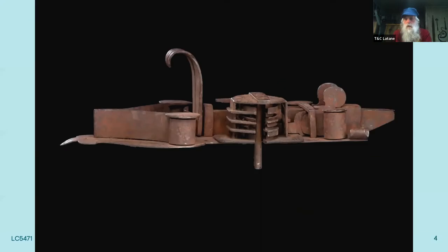This slide shows what you'd see looking at the lock from below. You can see how complex this ward box is — there are three ward plates attached to the left. When you have a spring-loaded bolt, the key does not make a full revolution, so the key draws the bolts back and then reverses as the bolts slide forward. The pin reaches into the door so the key fits over it and is guided into the lock. The pin also supports the key in its rotation.